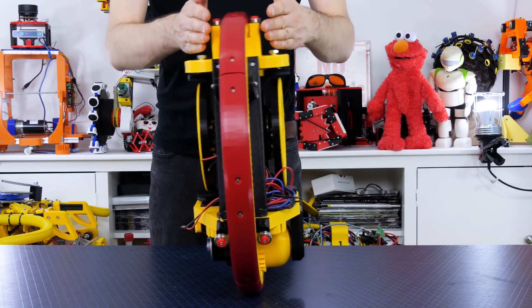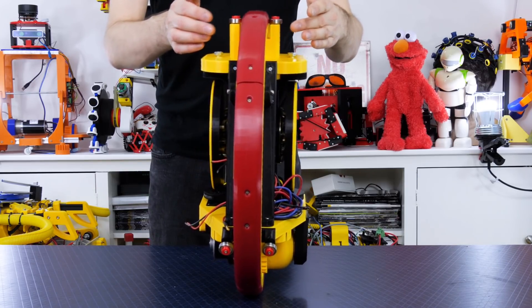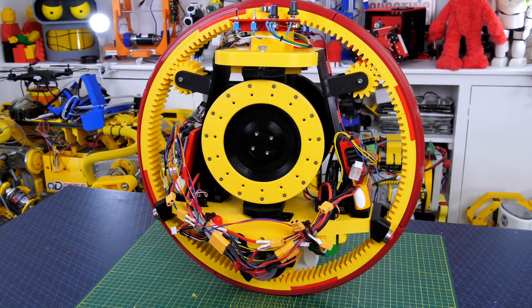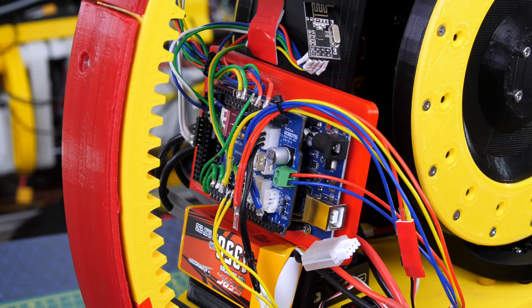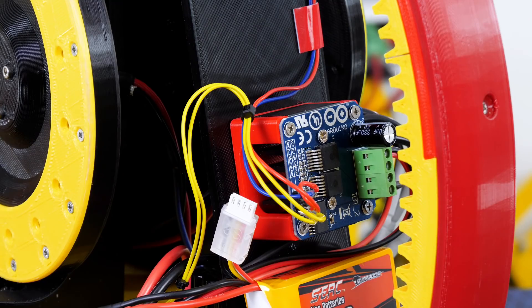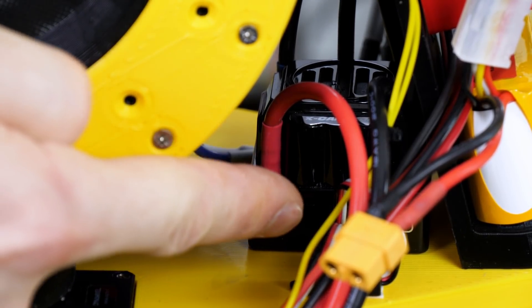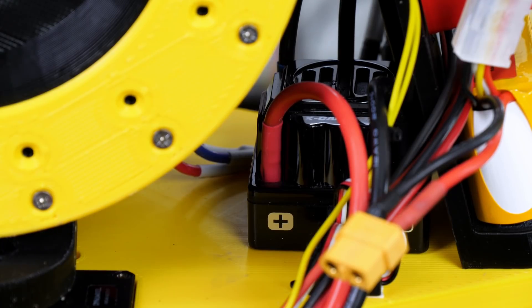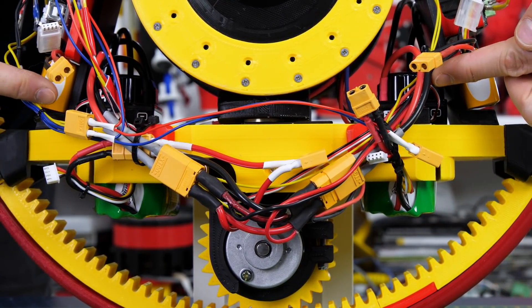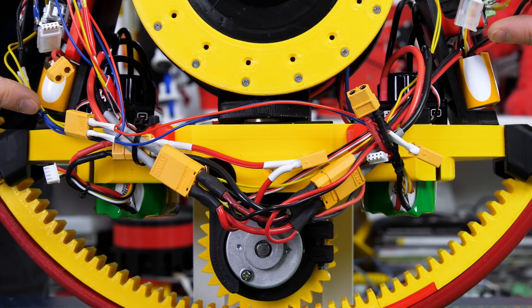There is a slight flat on the tyre profile but it's actually very difficult to get it to balance in the middle if not impossible. It is quite well balanced due to the way that motor's fitted but it won't stand up on its own. I fitted electronics to keep it balanced — that includes an Arduino Mega with a Dynamixel shield to control the servo that operates the gyros, and an Arduino Nano with an MPU-6050 inertial measurement unit to measure the angle and send that over serial to the Arduino Mega. The big DC motor that drives the main wheel is driven by a BTS7960 motor driver, and I've got two Hobby King X-Car Beast ESCs for the two brushless motors that spin the gyros. The brushless motors run on 24 volts from two 11.1V LiPos in series, and I've got another two smaller ones in parallel for 12 volts to drive the Dynamixel servo.